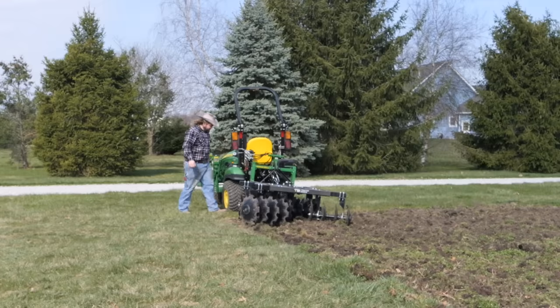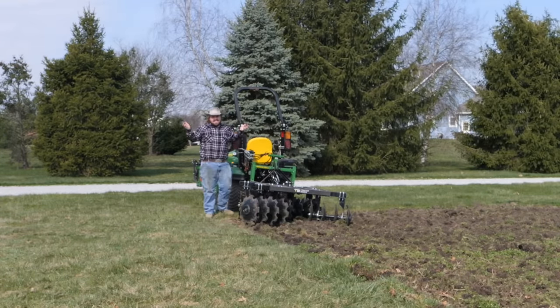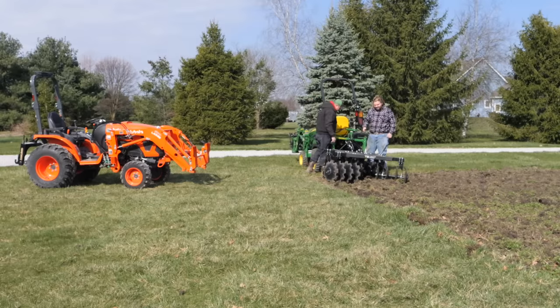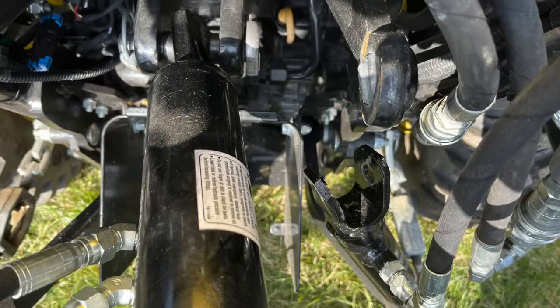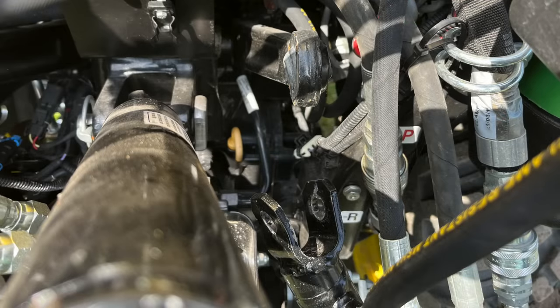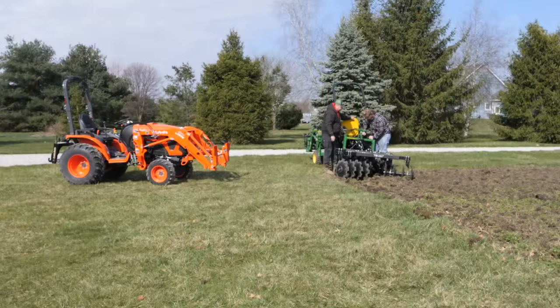That's not good — it looks like our top-and-tilt snapped. I got to the end, went to raise it, and it picked that side up and I thought I had a hydraulic issue — but no, it was all the way in. I believe this hose hit it here and knocked that key out. Next time we put it in, we'll put it on the inside. We've bent this side link a little bit, but that's just a project — we'll bend that back.